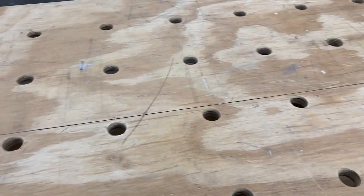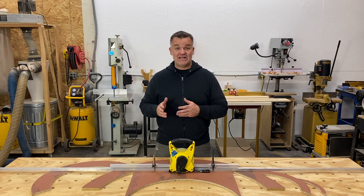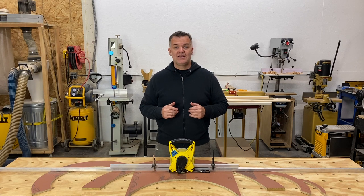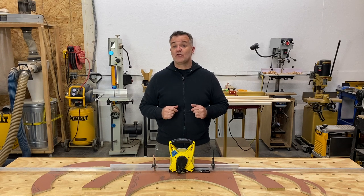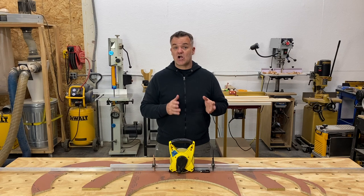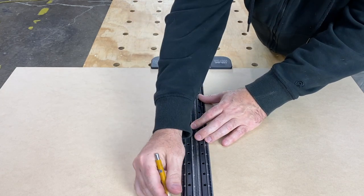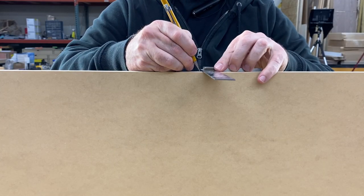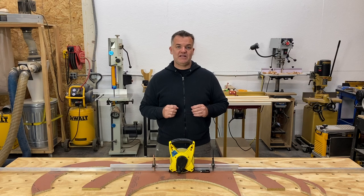When drawing arches in my shop I use my workbench. I've drawn a straight line down the middle as a reference. With this setup I can draw arches up to 8-foot radius — for example, a 10-foot wide by 24-inch tall arch. To demonstrate, let's use a 30-inch wide, 8-inch tall arch. First, select a piece that is large enough for your arch and has a straight edge on the bottom. Next, draw a center line perpendicular to the base, make a mark 8 inches up, then extend those lines down the front and back edge to help set the piece up with your registration line.